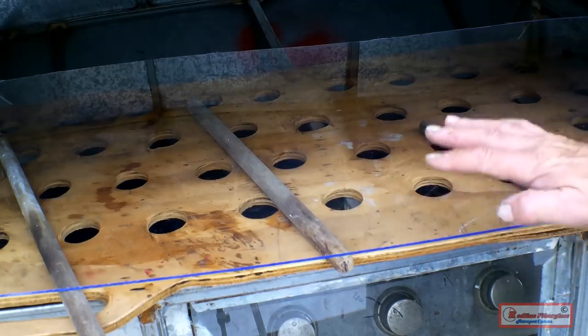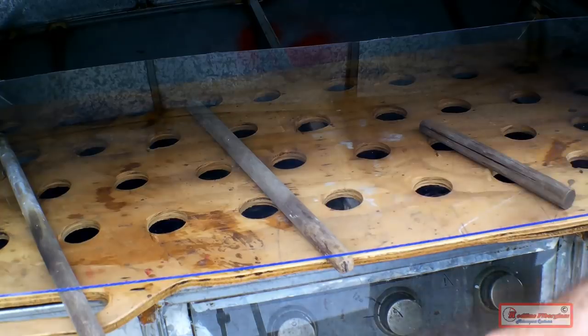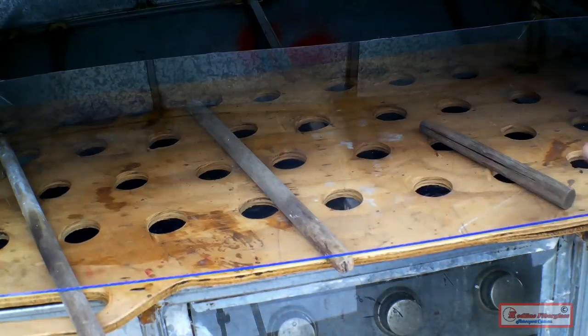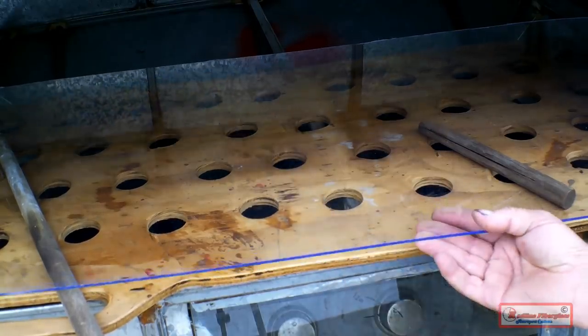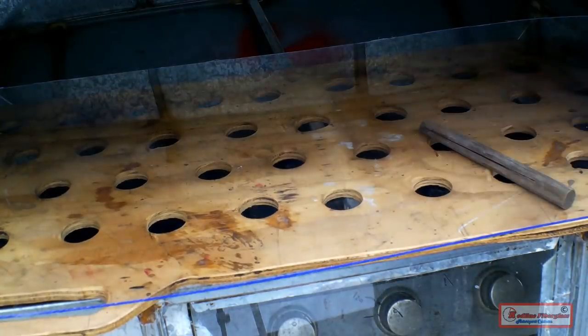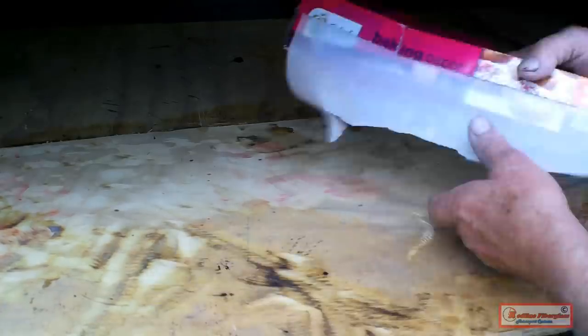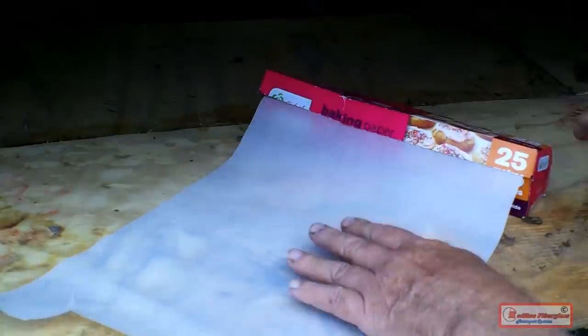When your plastic is fully heated and soft, you want it absolutely flat before you whisk it out to put it on your mould. But your sheet goes wavy when you bake it on these dowels. So I've since found for baking, it's better to not use the dowels and to not use the sheet with the holes in it. So I've gone back to a plain plywood shelf with no holes in it, and I put baking or cooking paper on it to protect the plastic from scratches off the timber.